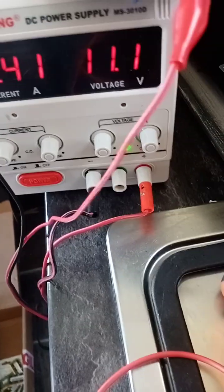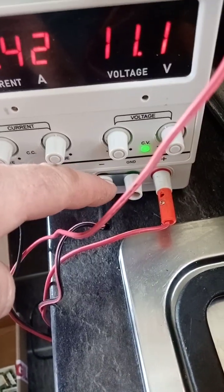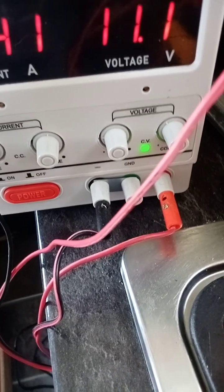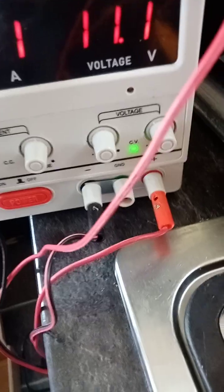But anyway, how to use these machines. The first thing you want to do is put that wee steel piece there, between your negative and your earth. Now at the moment you'll see we're using voltage. We're injecting it with voltage, but it's stabilising the amps and charging the battery. Okay, so we've had to bring the memory back.